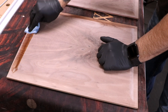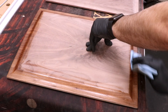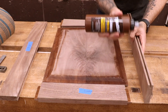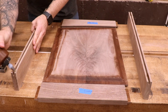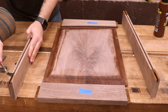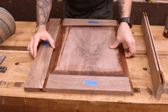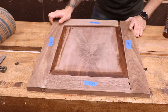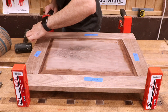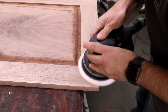Before assembly, I'll wipe some finish on the perimeter of the panel to ensure we don't see any bare wood if the panel decides to shrink. Time for the glue-up — I'm using hide glue again for extra working time. We put plenty of glue on the tenons and in the groove area that accepts the tenon. While the panel just floats for the most part, there's no harm in putting a dab of glue at the very center, assuming there's room on both sides for the panel to move. Joints like this don't require tons of pressure, just enough to close up the gaps. After the glue dries, we'll sand the frame to remove the glue and any remaining mill marks.